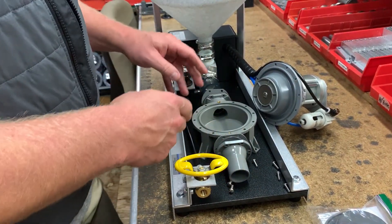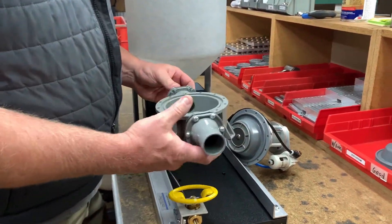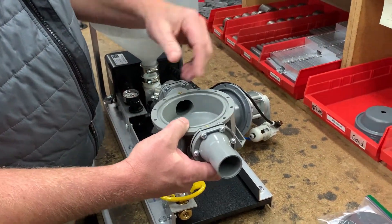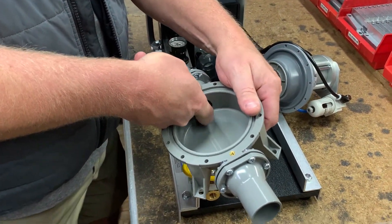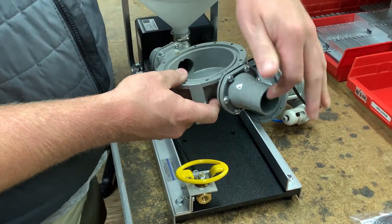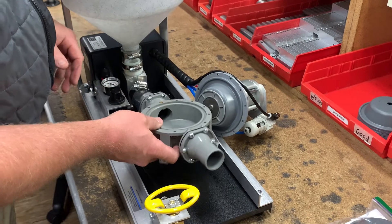A good way to confirm the flapper valves went in correctly — hinge to the top, flow direction correct — is to take your pump body like your ones and twos, flip it up, put your finger in, catch that little nipple, and flick it up. Do the same in the front. You should hear a popping sound as it springs back and smacks — that's what you want. If you can't feel that little tip inside, it's on the back side and you've got it wrong — take it apart and turn it around. Always do that check the first time.